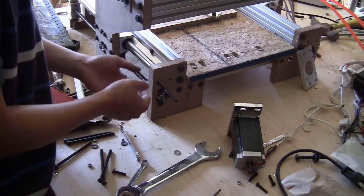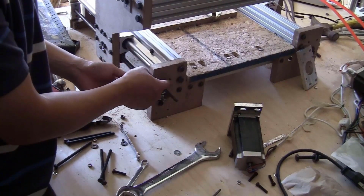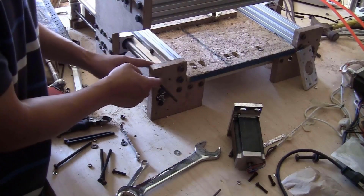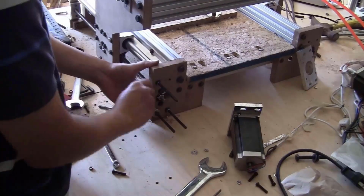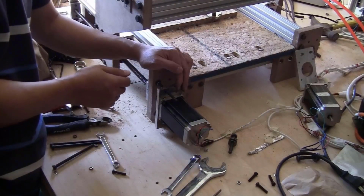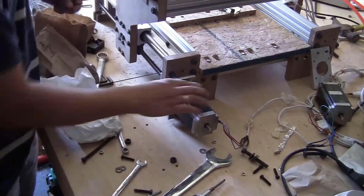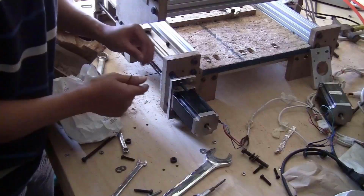This happened again. I didn't pay attention that I was designing the bracket for aluminum pieces. So this hole will be threaded with the M6 thread. But now because it's made out of MDF, I need to slide the bolt through. But it got blocked by this rail. So I will have to skip this hole. Again, I will need some of the M8 nuts as spacers. That's it. I will do the same for the other side. And then I will test the whole setup again.